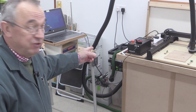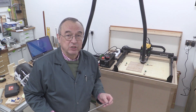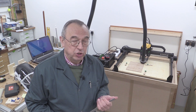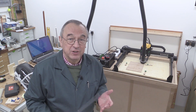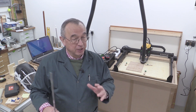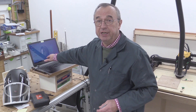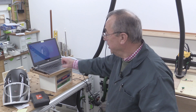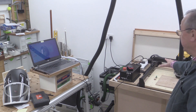Now this video is divided into two, and in this video we're going to use the CNC which I have behind me. I produce all of my tool paths using Vectric Aspire. For everything I'm going to show you today you could also be using Vectric VCarve Pro or VCarve Desktop — they both have the same functionality. From within Vectric Aspire I can produce the g-code files which are sent to the CNC, and I use a little program called Universal G-code Sender which handles all of the file transfer and handshaking between the computer and the CNC.